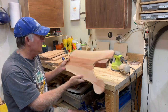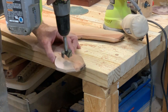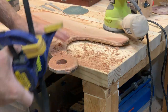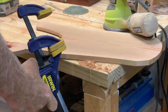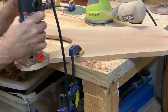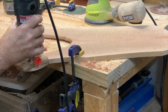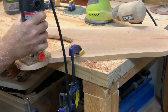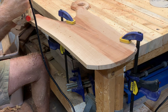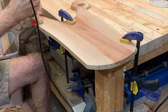I may reshape that a little bit more, but it's looking good. I've got my inch and three-eighths inch Forstner bit. We're just going to drill a hole in here. Drill the other side that way we don't blow out this side. There we go. Now I'm just adding the roundover to the hole in the handle that I made. I take the whole board on both sides and just add a roundover to all the edges to get it nice and smooth.